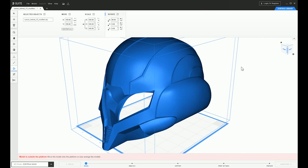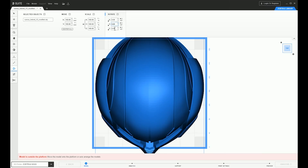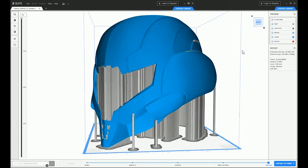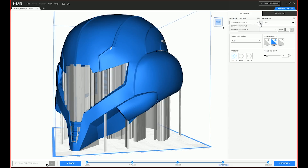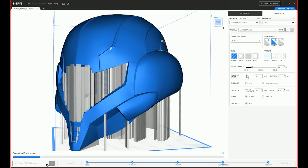The model was slightly too big for the print bed at that orientation. Printing a helmet upside down would probably use less support material, but I watched Joel the 3D Printing Nerd's video on printing a stormtrooper helmet on this printer — the Z-HIPS supports looked like they were fusing to the print surface and wouldn't release cleanly from the outside, requiring extra cleanup. I wanted as clean an exterior surface as possible. Rotating and tilting the helmet made it barely fit. The raft and support were auto-generated. I lowered print quality to normal with 0.29mm layer thickness, bringing the print time from over 7 days down to 4 days and 20 hours.